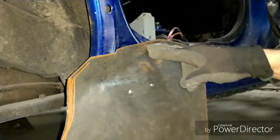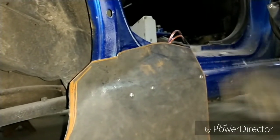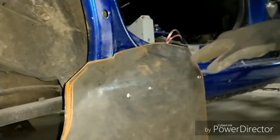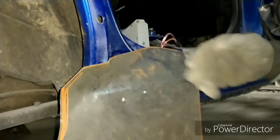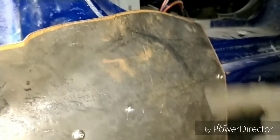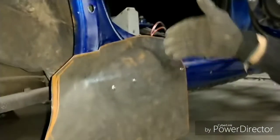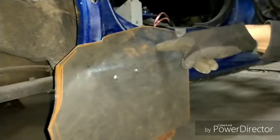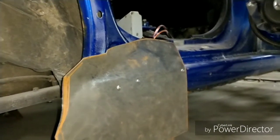So that's basically what I'm going to do, is work this until I can see the hammer marks coming through where it's stressing on the backside panel. And then after that, I can start working into the actual pocket itself, because here it's hard to see with the camera, I'm sure, but you see this little swoop here happening. That's actually a lot of pressure. That's a crease. That's an edge that's actually come up. You can feel it. So I've got to start working that, because that's a stress point that's starting to come out and saying, hi, you need to address me.